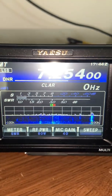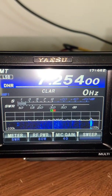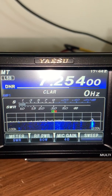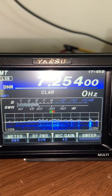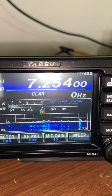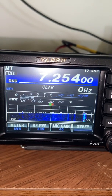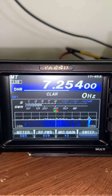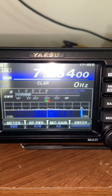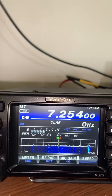Let's listen while I turn it off and on. The other thing I can do is turn the RF gain down a little bit. When you do that, you lose the ability for your S meter to give you a reading. However, it's very effective for audibly reducing the noise and improving signal-to-noise to turn that RF gain down a little bit — you don't often have to run it all the way at the top end.